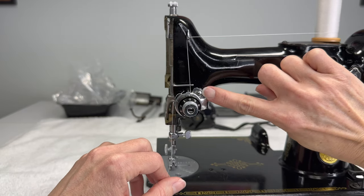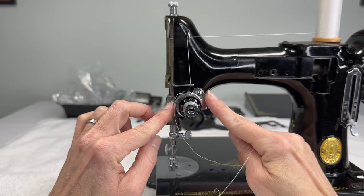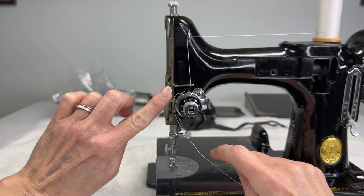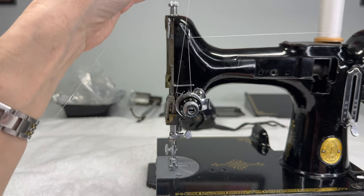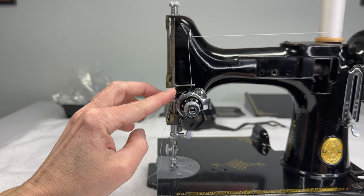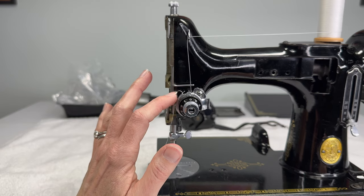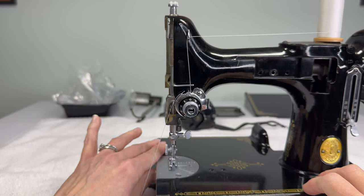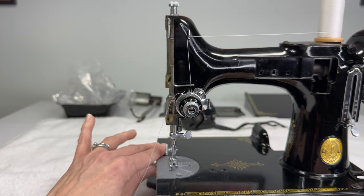At zero we still have a little bit of tension when the foot is down — that is good, you want just a little bit. We'll fine-tune this later during our first test, and we'll check the setting of the slack thread and tension guide. Loosening that screw lets it spin slightly clockwise or counterclockwise, which changes the location of the little finger the spring rests on — we'll cover that in another video. The next video we'll put the wiring back into the machine, and after that we're not far from sewing with our featherweights. Thanks — see you soon!